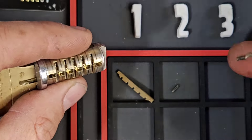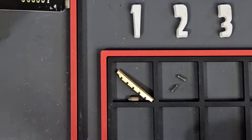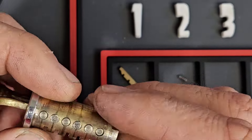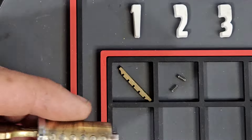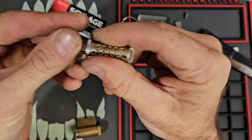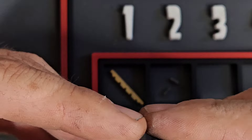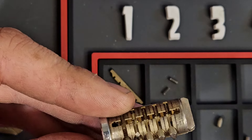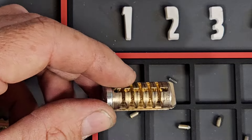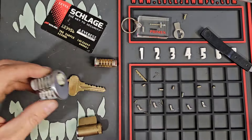The sidebar is what makes it more complex than a typical average lock. We've got two springs that hold that sidebar up and away until the finger pins meet the shear line. So there is a secondary shear line — we have the typical shear line of the average pin tumbler lock, and then you also have these finger pins on the side that interact and engage with the side milling on the key itself.